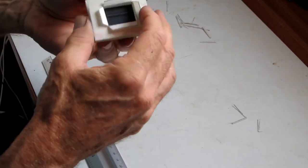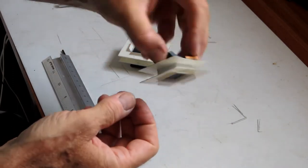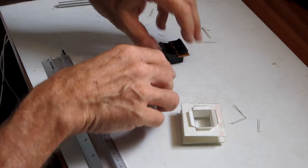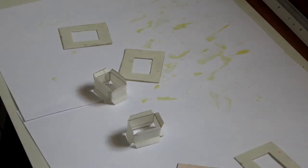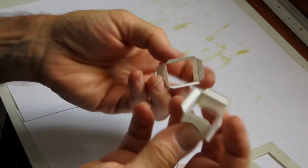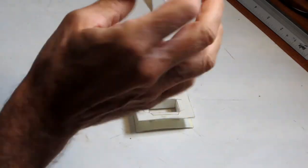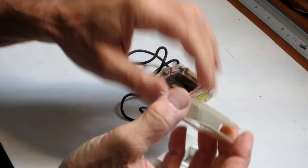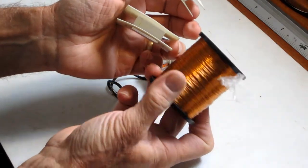Here I'm at the next stage — I've now got them to exactly the shape I want. These end cheeks are quite nice and flat, probably as flat as I could hope for. I've got it so I can join all the components of my bobbins together. The next stage is just to glue the bobbins together and then think about how I'm going to wind the wire. That's got these glued into shape — next thing is to glue the end cheeks to those, which shouldn't be too challenging. My two bobbins are made and I'm actually pretty happy with how these look all glued together.